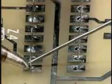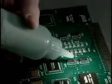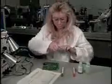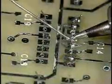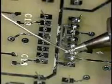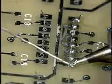A pulse feed with flux cored solder may provide better results because the flux is constantly being fed. Limiting flux application will minimize flux residues. Always try to use the same flux for rework that was used for the initial soldering. Visible residues from a no-clean soldering process may not be rejectable. Each company will have their own criteria for how much visible flux residues are allowed.